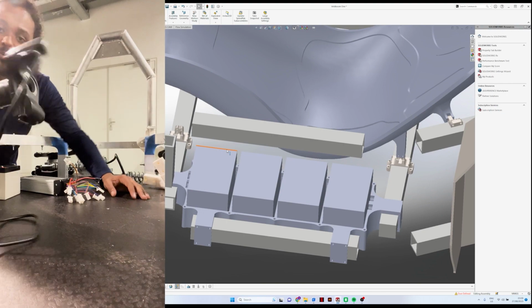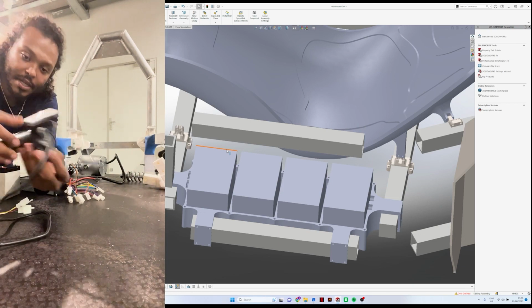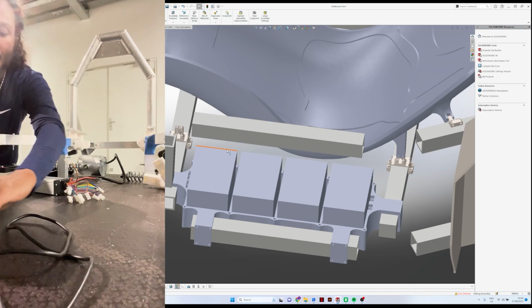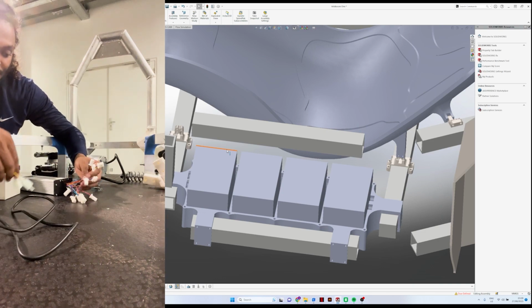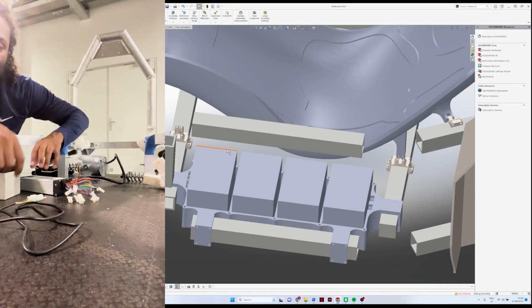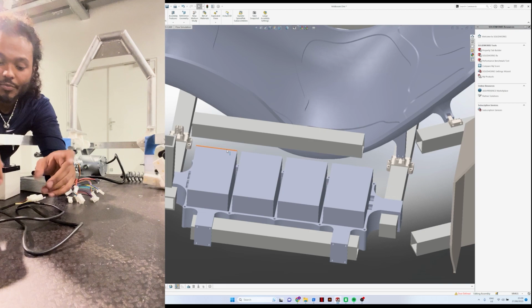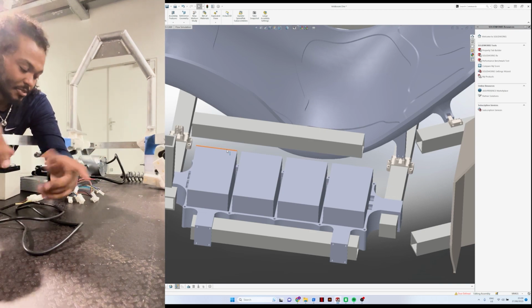So this throttle is basically a rotating sensor. As soon as you give it some input, it will send a signal through this cable, through the computer control unit, through the throttle input cable that I just showed you. So we need to connect those up. There is a certain percentage of power that the driver requests from the system, basically.